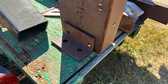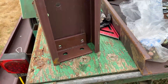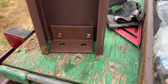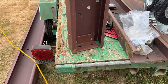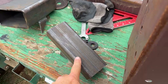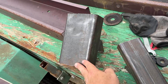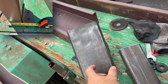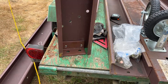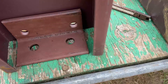Should I go with the brackets depicted in the engineering prints, or do some modification and do my own thing? I believe this is a much neater way. My engineer said it's actually better to do it on the inside to keep the C-channel from buckling in on itself — otherwise it's virtually the same. So this is what I'm going to do because I have to mount these onto these brackets. Because this is only a 2x3, I've only got so much room. Even this one is just a little bit short — if I put one on one side and one on the other, I'm going to have a little bit of overhang. So I'm going to put everything just like this, even though the engineering prints do not depict it this way.